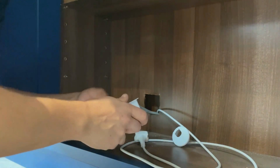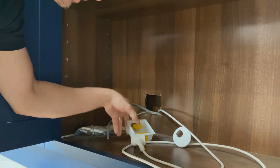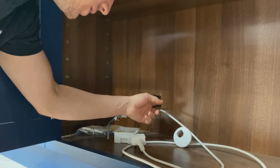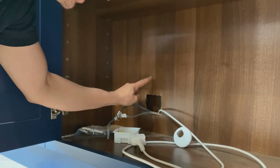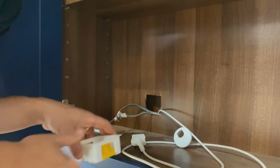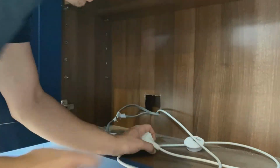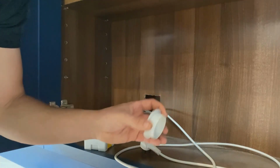So in this cupboard I'm going to put a dry lining box in the back here. Luckily enough for me, because of the quality of the kitchen, the fitter actually cut all these boxes out for me, so a little bit of cheating. But yeah, dry lining box, and then we've got the cable here for the dishwasher, which is the other side of here. But what I'll do, I'll cut a 50mm hole.